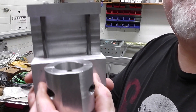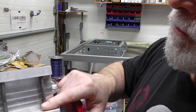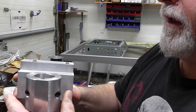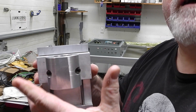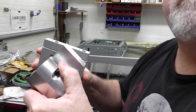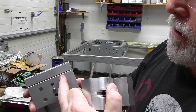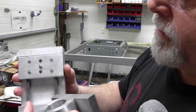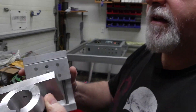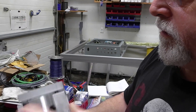I just need to mount a couple of micro switches and add some springs on the sliders here — it slides up and down. The breakaway works like this: if a piece is flipped up on the table and the torch hits it, it will break away. I've got a little pivot there and four rare earth magnets on the back side and four on the front side — she's pretty strong and won't wiggle loose.